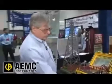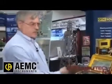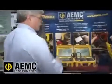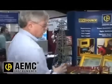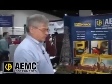You put your auxiliary rods in like you normally would, and then you just take this clamp and you go around at different points, and you can find bad spots without having to move all the wires all the time. And then we also test what's called soil resistivity. Before you install a ground system, you want to know how receptive that soil is for absorbing electricity, and so that's a function we do there. And then the major feature of it, what we call the ground flex method, where we use these sensors to measure the resistance of towers.